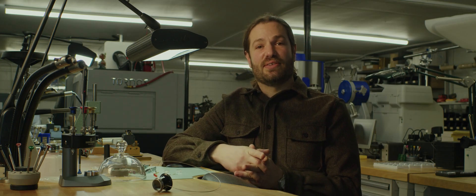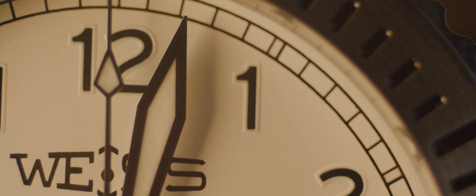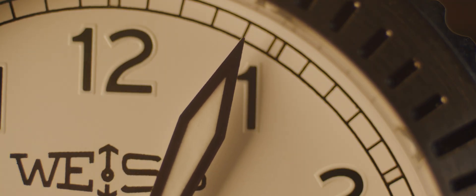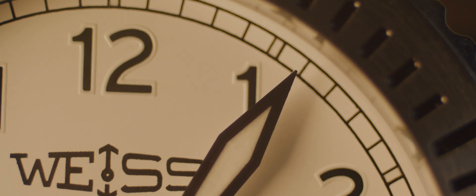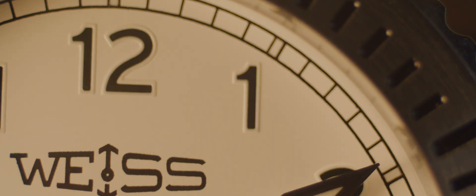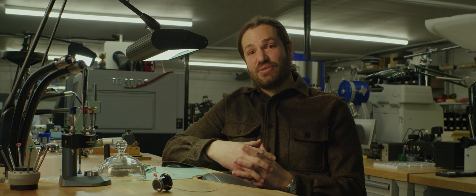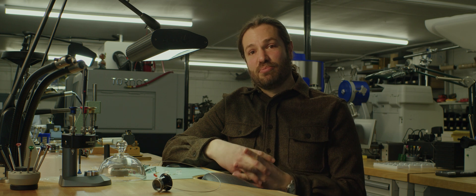We want to make sure that we can transfer that to the hands of the watch — the minute hand going once around the dial every hour, the hour hand going once around our 12-hour dial every 12 hours, and if we have a second hand, we want that to go around once a minute. A traditional rate for the oscillator, or the balance wheel, is 18,000 beats per hour. That's a traditional frequency, and knowing it allows us to design a gear train ratio around that number.